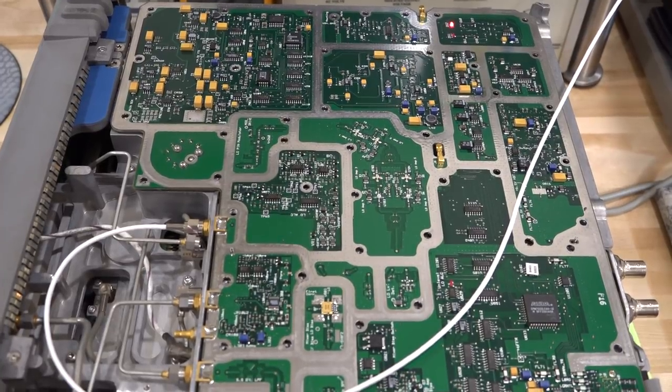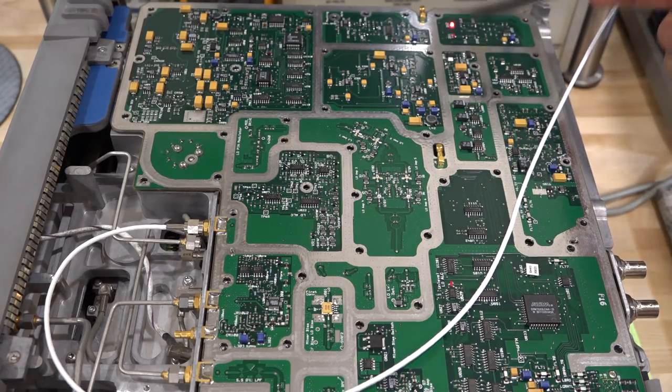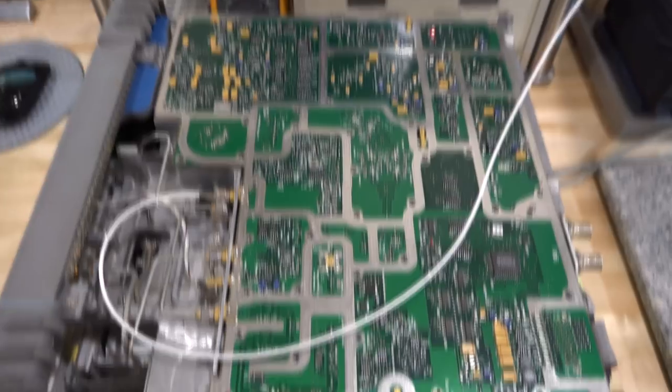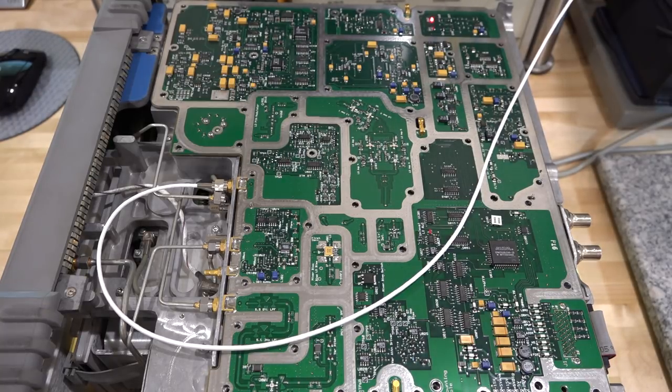The LEDs on the board can also be helpful. There's an unleveled LO-ALC LED — that would be lit if the LO signal was weak and the ALC could not level it — that's off, which is good. Here are the two LEDs from the charge pump: one is on, the other is off — meaning it's banged against one side of the charge pump's maximum dynamic range, so obviously it's not locking. Since we already know the divider could be a potential failure, why don't we measure that first? The disadvantage is the divider is on the other side of the board, but let's do it as a first starting point since it failed last time.